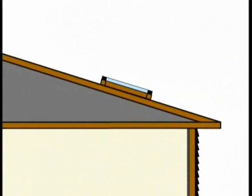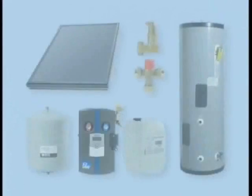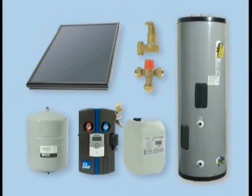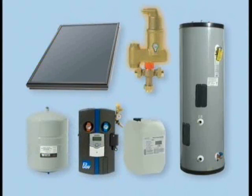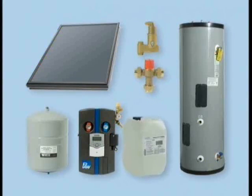The solar collector can be installed on roofs with a 3:12 pitch or greater. Velux supplies complete solar water heating systems with all the necessary components. These include solar collectors, solar hot water tank, expansion tank, pump station, micro-bubble air separator, thermostatic mixing valve, and glycol.